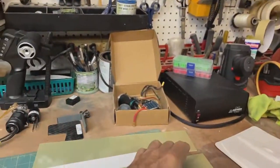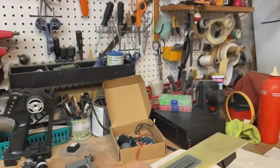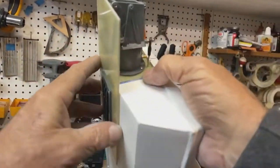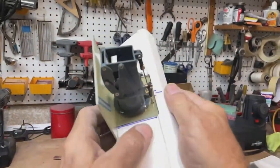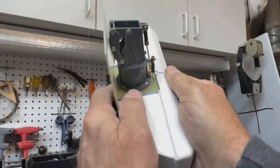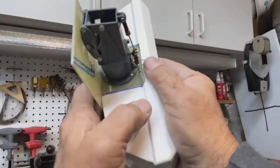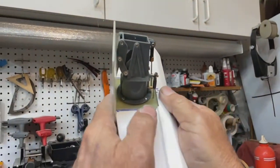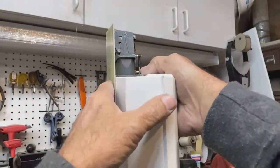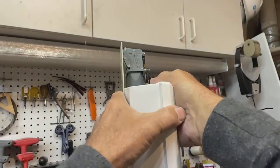I had this working quite well before. It fits in here — there we go, there it fits. So I'll just tack it in with epoxy to begin with, then come back later and make an epoxy and shredded fiberglass mix and fill everything in. I will now have a transom that's perfectly perpendicular.